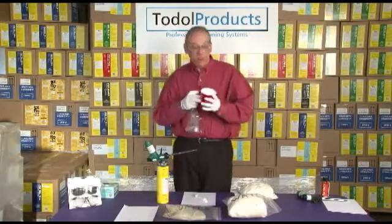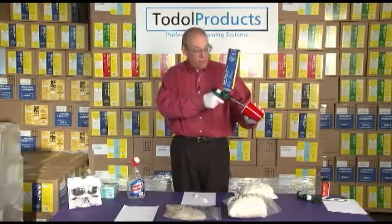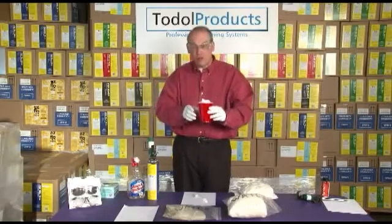So if I was filling this plastic cup, I'd spritz it once and then foam. Now I'm giving it moisture down in the bottom of the cup, and at the top of the cup it's going to get the moisture out of the air, and this will give a full cross-sectional cure.